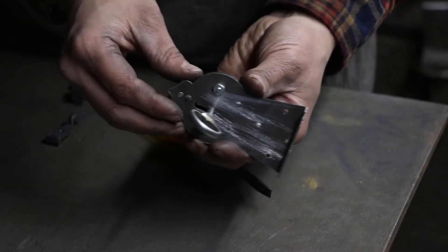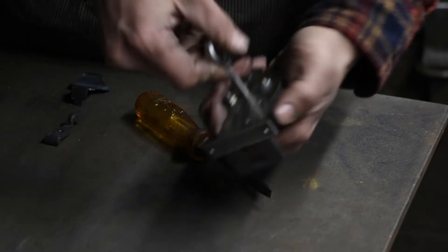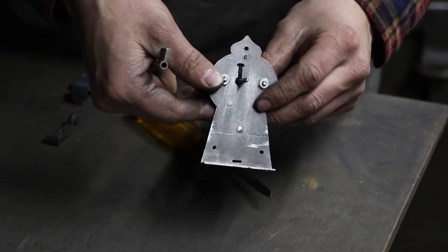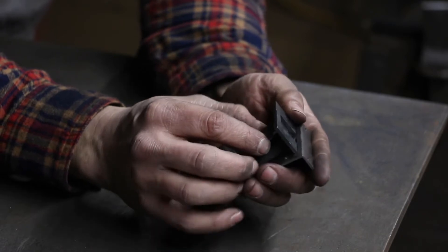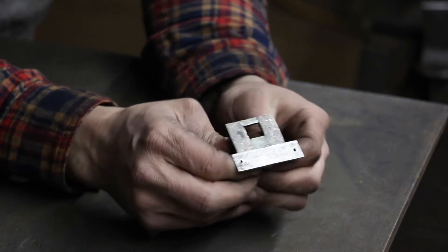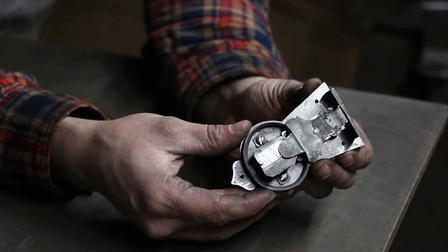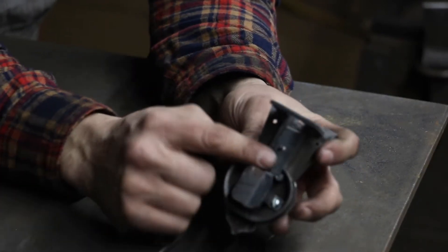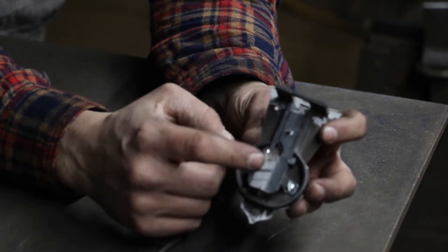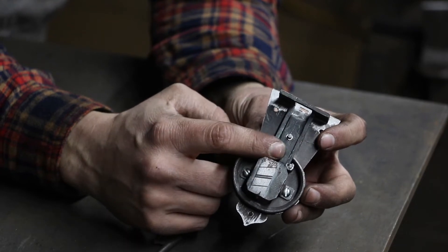The key post I've got on here is just a hair out of center for this key, so I'll have to make a little bit of an adjustment for that. Trying to put everything together at the moment gives a good idea of what it's going to look like. At the moment I can't even put the key all the way in because the lever on this tumbler is actually in the way of the key going all the way down onto the post, so I'm going to have to trim that.